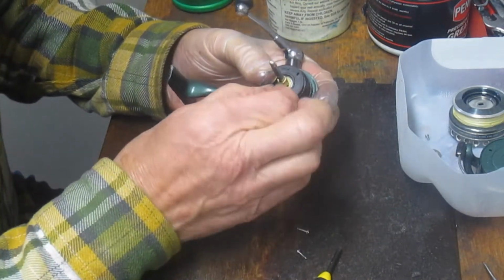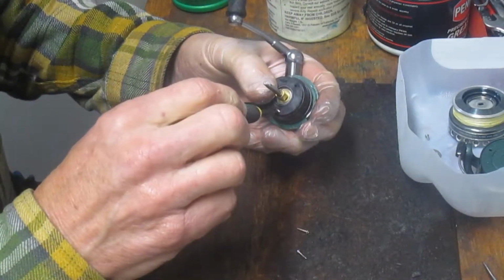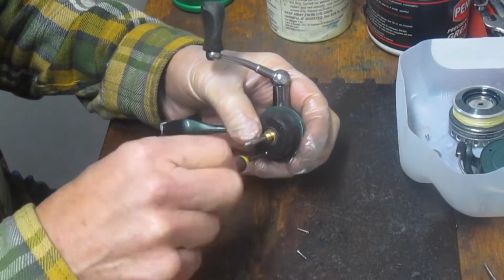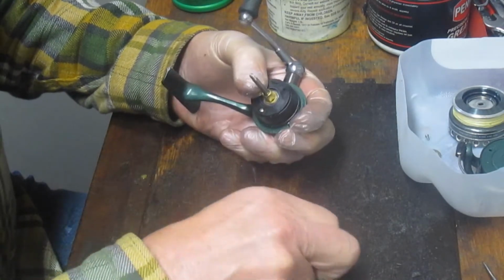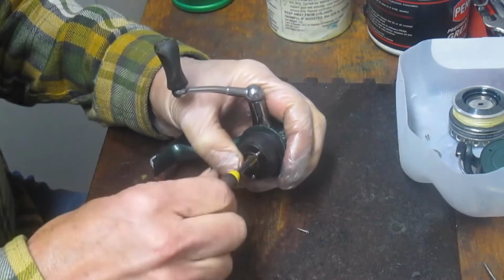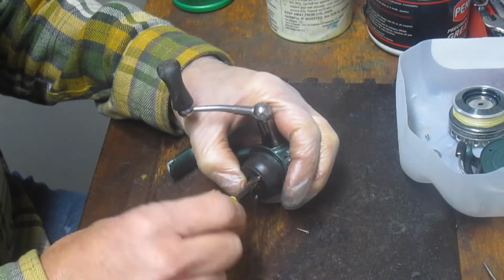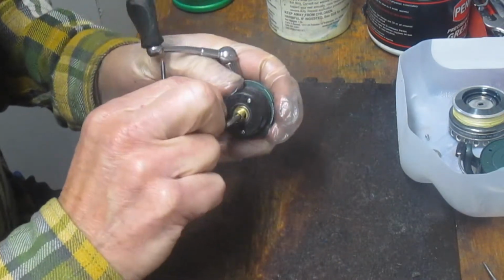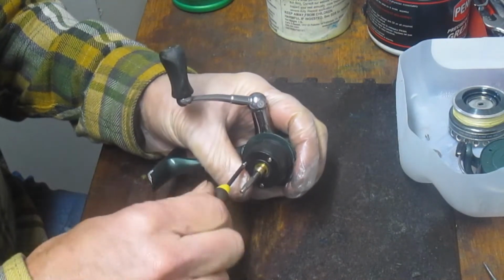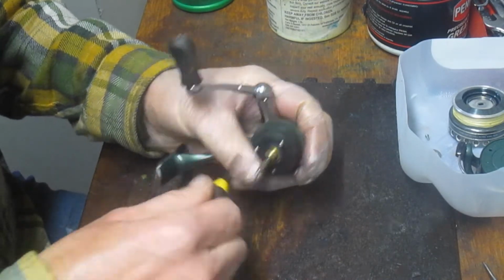There may be a throw arm in the way, like a reverse override switch or something else, and they need to stagger the screws on it. So pay attention, and eventually you will get it lined up. I just did one the other day on the instant anti-reverse for a Shimano reel that somebody had asked about, and when I took the collar off of that one, not only did it have offsets, but it had a front side and a back side. So if you would put it on upside down, you could not line up the teeth properly. Doesn't seem to be the case here.